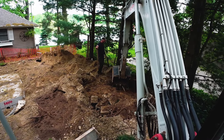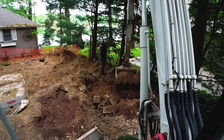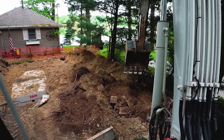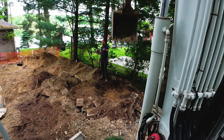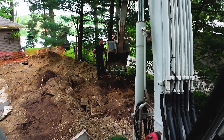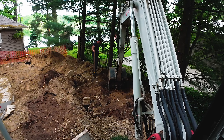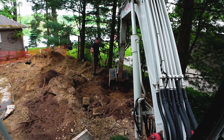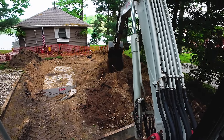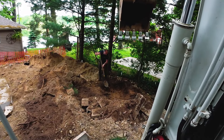This is a labor of love between operator and laborer — and honestly it's the most crucial part of the job. This is a slow and tedious process. We're ten minutes in and we've only got this much exposed — that's okay, this is not a race to the finish. We're probably about 14 inches deep in 10 minutes. This is an exception because of the tree roots, but still, exposing utilities is not going to be a super quick process. When you go fast, that's when you hit it.